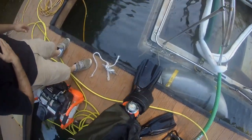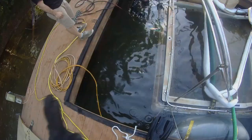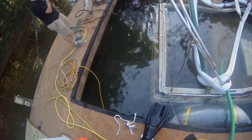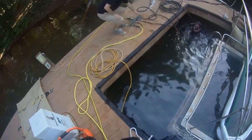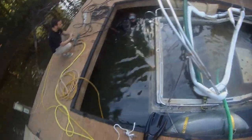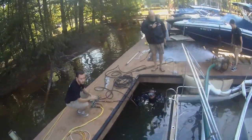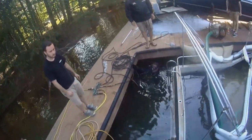Standing up on the dock now looking down, you can see the very tight space we have to work with. I've got my other salvage diver still on the stern of the vessel, giving last-minute pointers to the SeaTow crew members and letting them know how we've got things rigged. As the bags start to inflate, they are going to take up even more space inside this slip, and we don't have much room to operate. We're discussing whether to add another bag underneath or just continue to pump. We've got the gunwales completely out of the water — the cabin area is still submerged, but since it's sealed off, no water can come in, so we can start pumping and let the vessel raise itself.